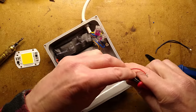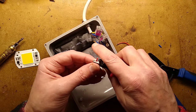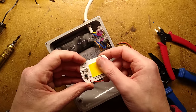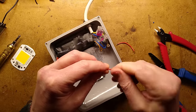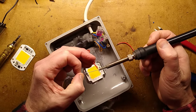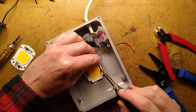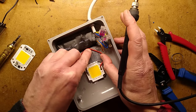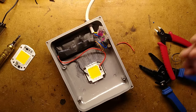Maybe I should look at new lighting. I did go online looking at power supplies and all the ones I could find are crappy little ones, smaller than this. Everyone else is just trying to push driver-on-board solutions — the super cheap ones that flicker horribly and are unsuitable for making videos. These wires aren't really twisting that well — probably tinned aluminium. So much mystery cable online these days. Buy locally from proper electrical distributors; don't buy crap from eBay if you need something predictable. There are so many corners being cut, largely because people have invested in copper as a commodity and in doing so have destroyed the electrical industry.